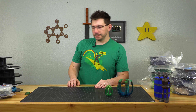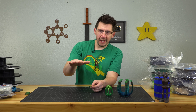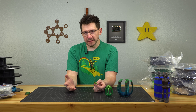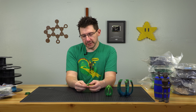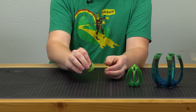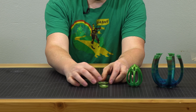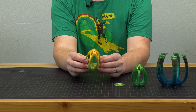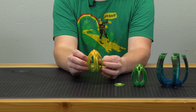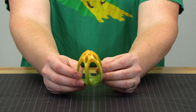I know I could take a knife and score it, but that would end in sadness and bleeding because I always cut myself. So I decided to do a test. On the Mark II, I changed the Z height just a bit — you've got the live adjust Z on the Prusa machines. So I turned it up just a little, just got it off the bed. I printed out just a start of one and all of the parts came out, not fused. So this new Z height would work just fine. This model printed on the Prusa Mark II 3D printer using the Proto-Pasta multicolored filament.